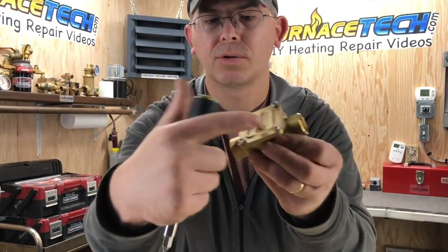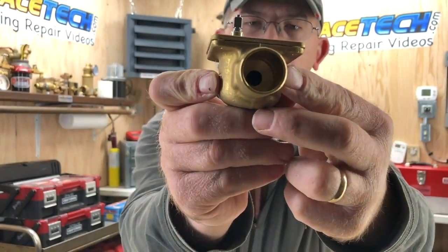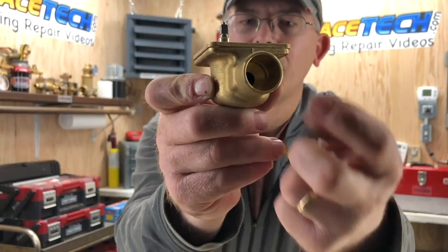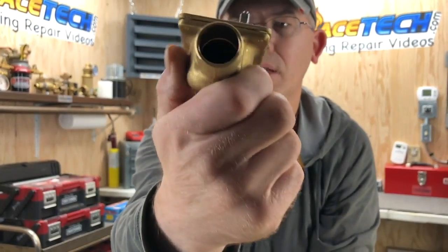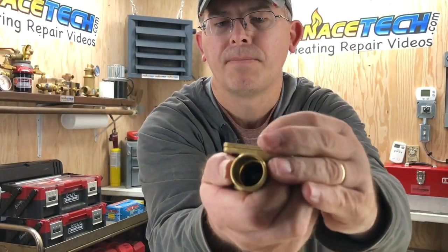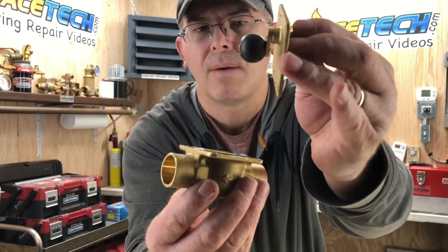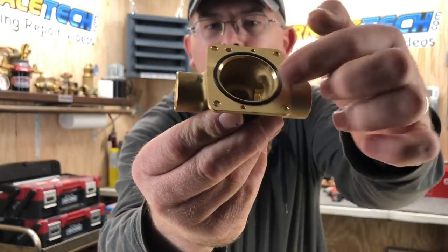The 11-in-1 screwdriver will take these little screws out — they're 5/16 screws. If you look at the inlet, you can see it's a much smaller hole. You can get zone valve variations with higher flow capacity, but this one has a smaller restricted hole. Looking in the outlet, you can see the little ball in there. I'll pull this lid off now — there is a little gasket and a rubber ball that seals it up. Inside the zone valve around the top, you can see the little O-ring gasket.